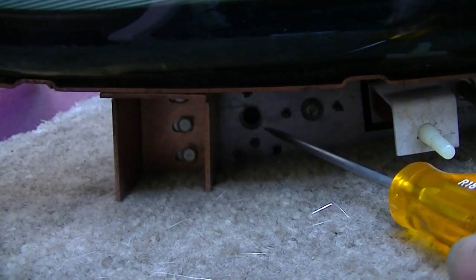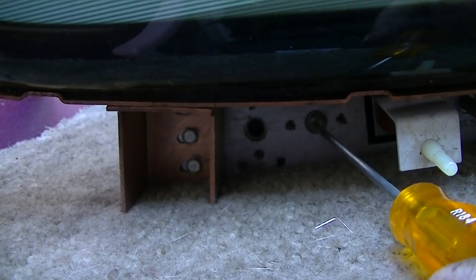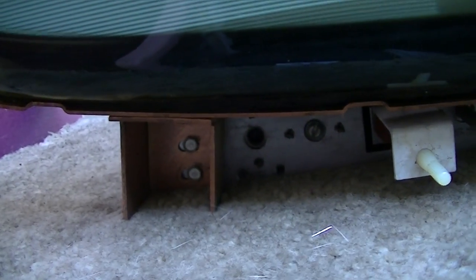Okay, well this one makes little to no difference. Yeah, maybe a little bit. This one's focus, it makes little difference. This one is sync lock, it makes a little difference, but not enough to be worth it. I need to just replace that double diode first. Hope that fixes it. The vertical seems still kind of soft. It's interesting, it's displaying the line here, but it's not displaying the line on this side.